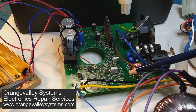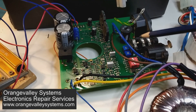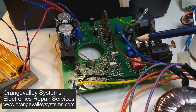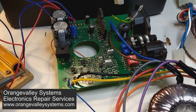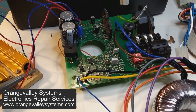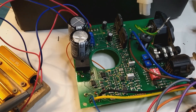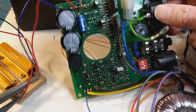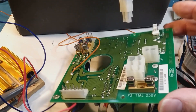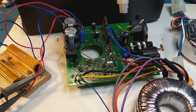If you put a 1kHz sine wave into it from a signal generator, you don't get anything out of the tweeter until you crank it up to around 6kHz, and then the output starts moving across. I imagine that's set by the DIP switches. There's no circuit diagram whatsoever for this board, but it's old-school electronics. Fundamentally it's not a class D amp, which in my book makes it infinitely more repairable than a lot of modern electronics.